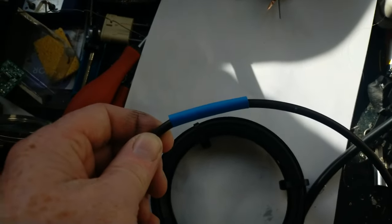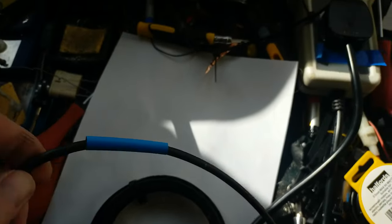I've slid this piece of heat shrink onto here. Because I don't have any adhesive-lined heat shrink, which is very annoying, I'm going to put a small amount of hot melt glue over that join there and then heat shrink that down. I'm just waiting for the glue gun to heat up. I'm going to set the tripod up and actually show you that part, because this is the part I don't believe Gary includes.